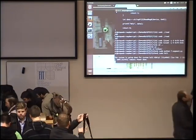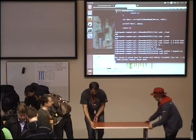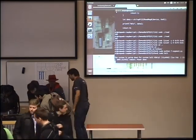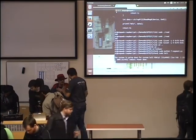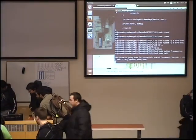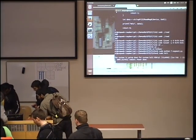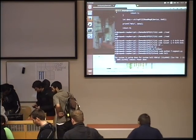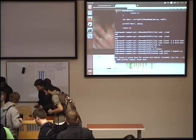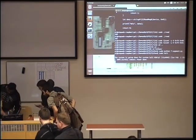And why did you have to do the ADC thing? I didn't understand. What is the need for ADC? So this one is needed for ADC, because this sensor is an analog one. Oh, okay. It's just a voltage divider. So you're reading from the sensor? Yes, it's an LDR. So you read from that, you have a program here, and send this information through I2C bus to your pin. Yes. Okay. So does this read temperature? No. Just a light thing. It's just a light one, so light thing.